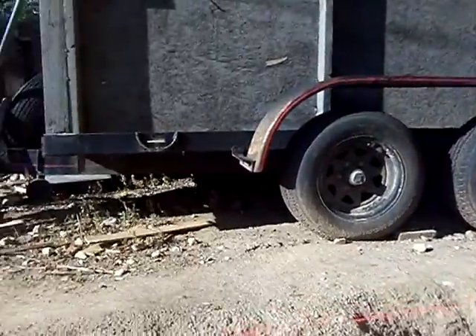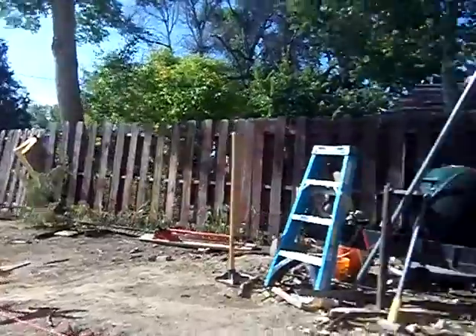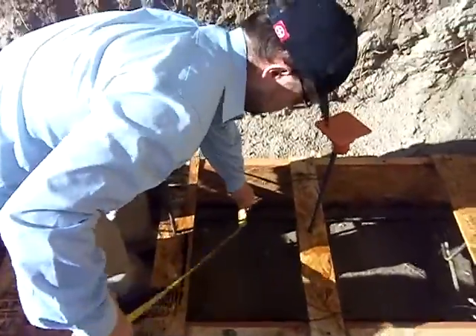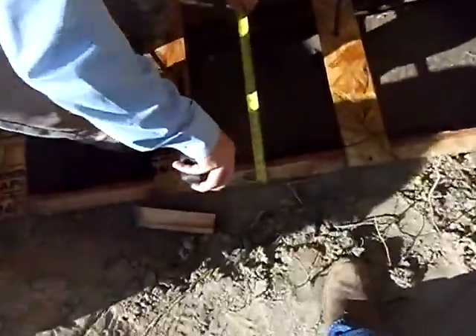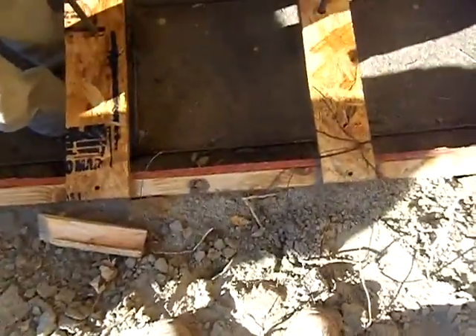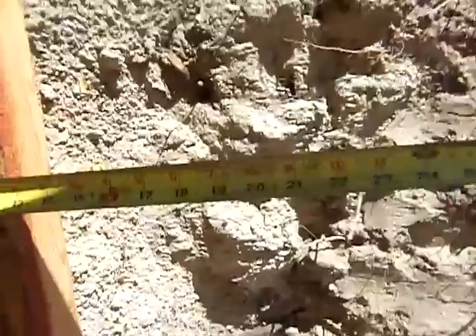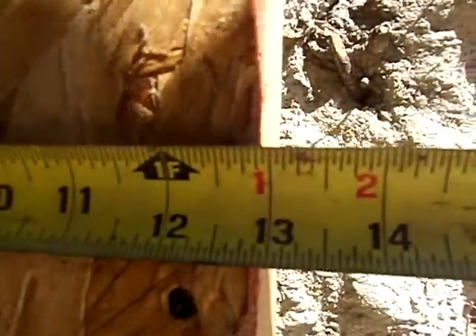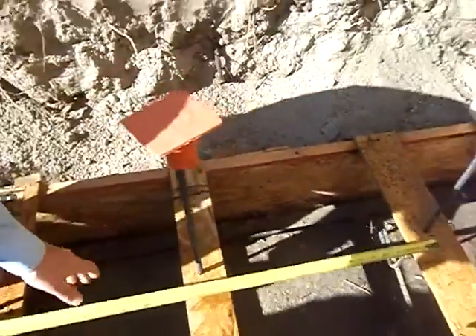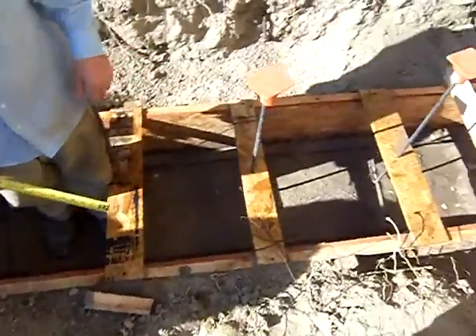This footing is 24 inches wide — show my 24 inches on the camera. We are 12 inches thick. My J-bars here are at about 23-inch spacing — show the other side of the tape so we know I'm measuring to my J-bars — so we're about 23 inches.